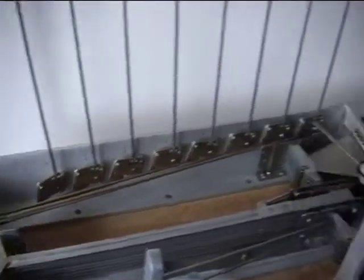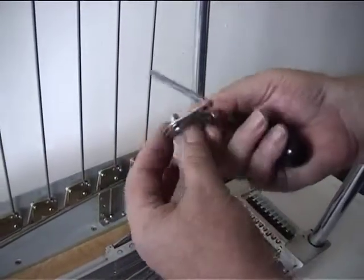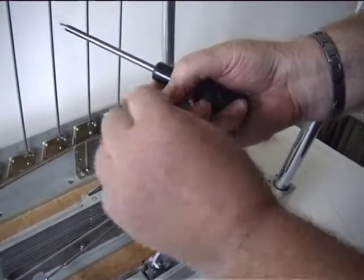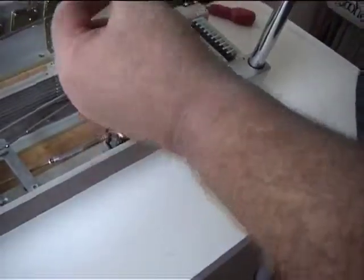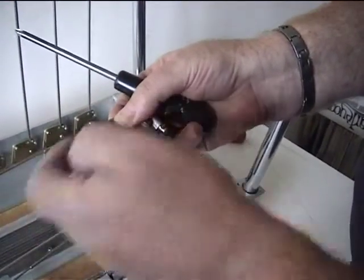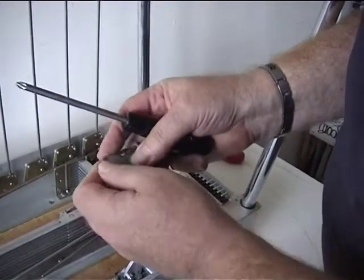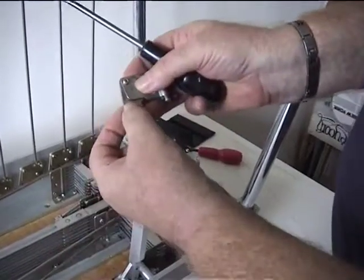You've got two choices. One is to disassemble this unit here. When you disassemble it, you must be very careful because it's not as simple as it looks. The inside part has a spacer sleeve that you can drop and lose very easily. That spacer is intended so that when you squeeze this together and tighten the screw, it still leaves freedom on that. Now I've assembled that wrong — it has to go like so. It's got a lock nut on one side.